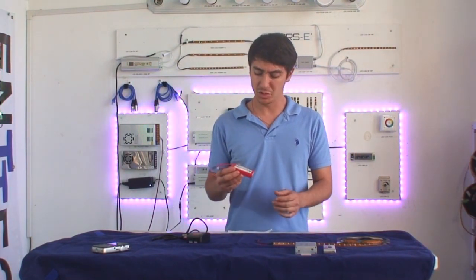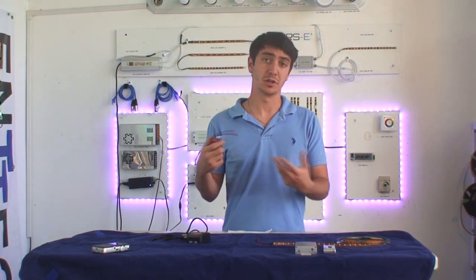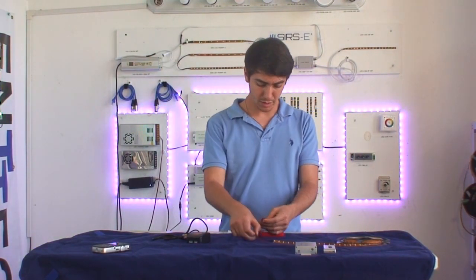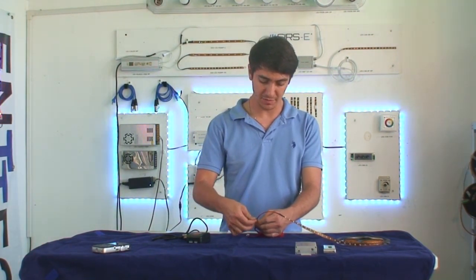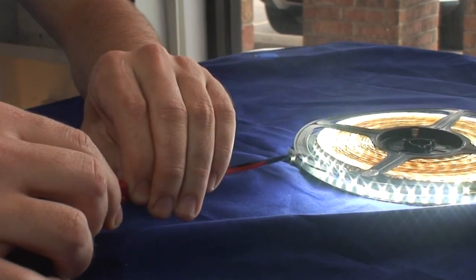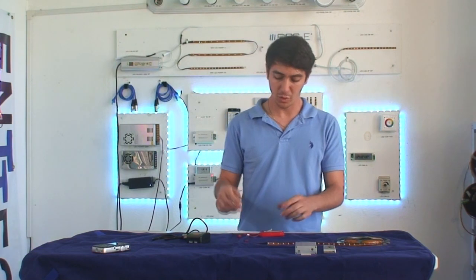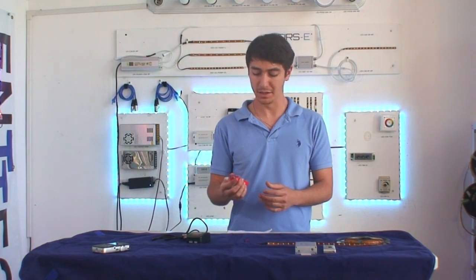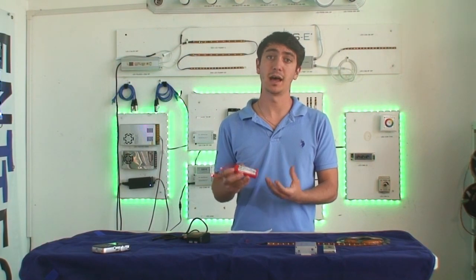Basically this could be used to substitute a power supply that is powering up your strip, your controller, your DMX controller, or whatever it is. You can simply tap into the positive and negative wires and you can actually get your strip to light up. Of course, if you do a more permanent, solid hold with the right connectors and the right solder and all that, you can get it on there solid and it's going to give you a really reliable setup.